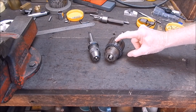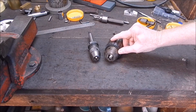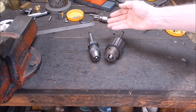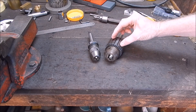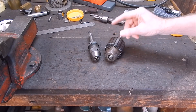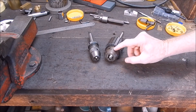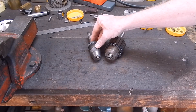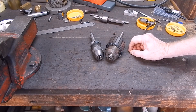It really wasn't a smart thing to do looking back on it, because even though it's a bigger, heavier chuck, the problem is that your drill size is pretty much stopped at 13mm or half inch. If you go and buy drills for regular use, most of the drills you buy are half inch, and then they go to a small shank if you want to go larger. So three-quarter inch is really wasted money. I have used it over the years to put big end mills in, just to bottom out or square off the bottom of a drill hole, but that's very rare. And the downside is it won't go below three-sixteenths, so you have to swap over the chucks. If you're thinking about buying a drill chuck, getting the three-quarter inch is a pretty pointless exercise all summed up.